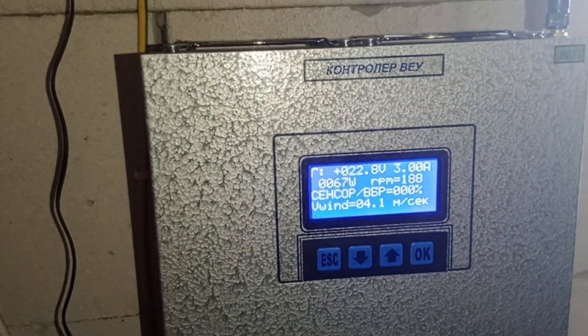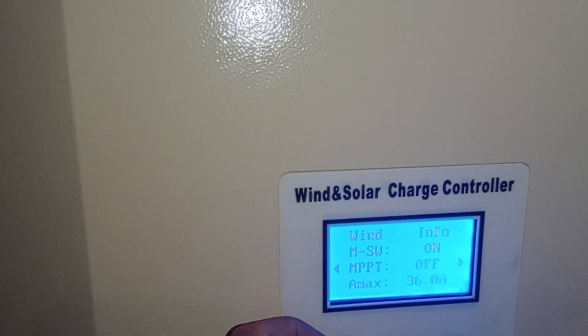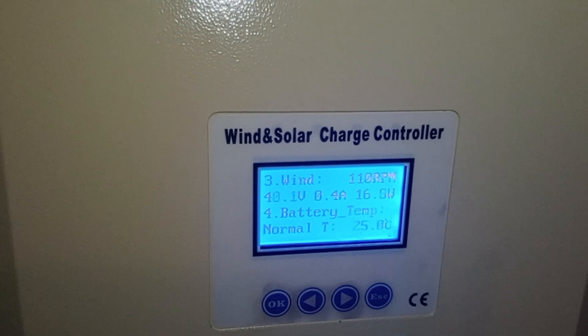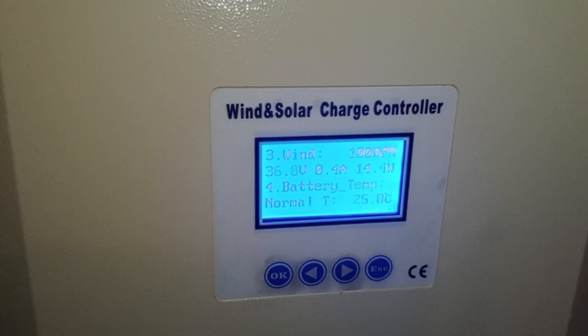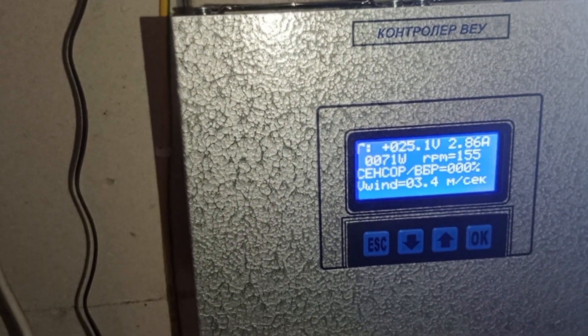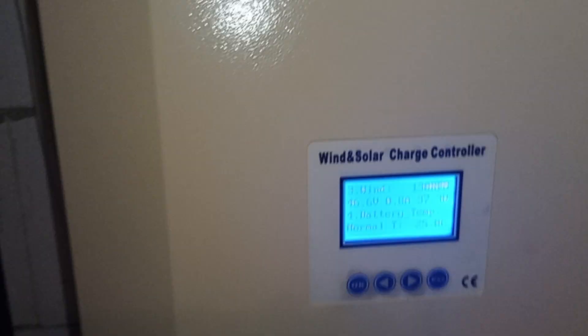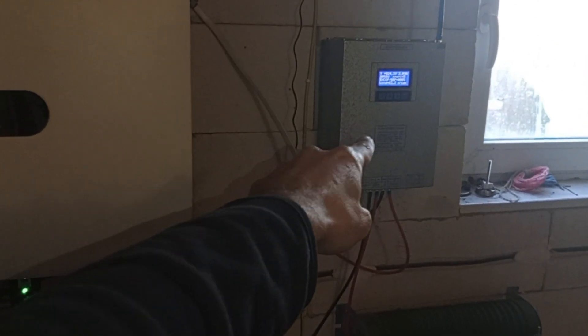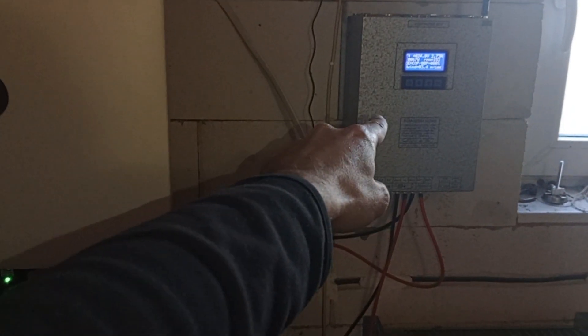The wind died a little bit, but that's the real difference — I'm not tricking anything. Let me try switching the MPPT back on. The cut-in is at 32 volts with some modifications so it doesn't push too heavily on the turbine. You see, that bigger turbine produces almost nothing, and the smaller one produces almost twice as much — that's the main difference. As I've said before, wind turbines must have their proper controller. So what I need to do is switch the controllers. The 96-volt system should go to the one with a buck module that can handle up to 150 volts from the turbine.